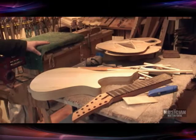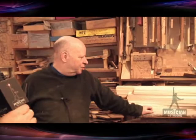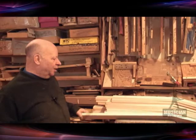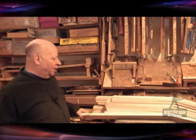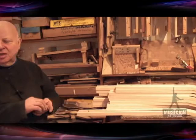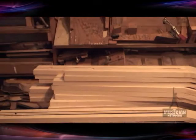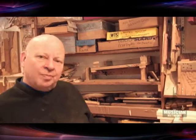This is very near the beginning of its life, its course through the shop. We were talking a little bit about the neck stock that you have here — tell me about this and what kind of setup time is involved at this stage. Andy does most of the rough work, but basically the wood's been cut to allow for this profile, to allow for the kickbacks — as we call them — to be glued on. It's had two channels routed for graphite. The advantage of graphite is it just seems to make the necks more consistent. It's not as important on some instruments — for a standard-tuned six-string we won't put it in, but on a five-string or a long-neck bass, we will.